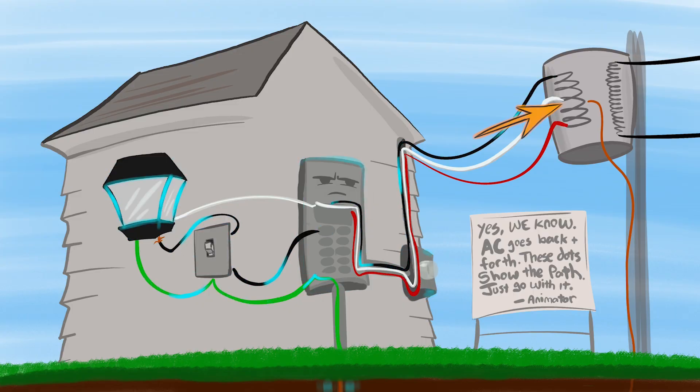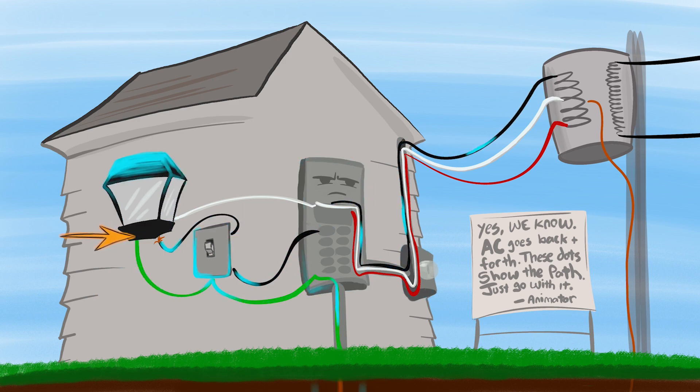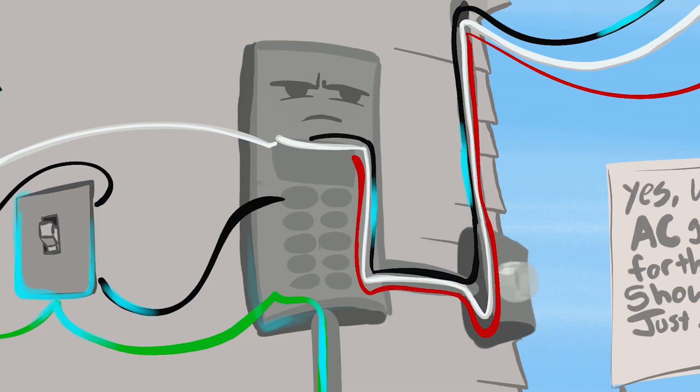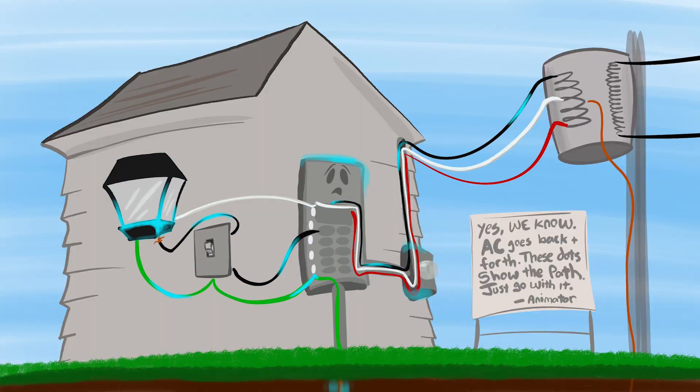If you follow the ground wire — the piece of metal on the fixture is attached to the ground wire, and the ground wire goes back into the panel and lands on the bus inside. But how does that metal bus, that strap, attach to bring current back up to the source to allow that full circuit to flow for the breaker to know there's a problem and trip? There isn't one. So we have to bond the neutral and the ground together to give a return path and complete the circuit, letting that breaker know there's a problem and it needs to trip.